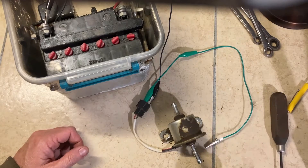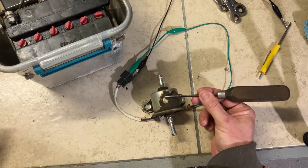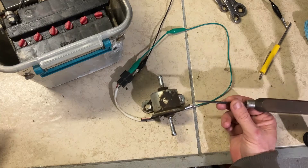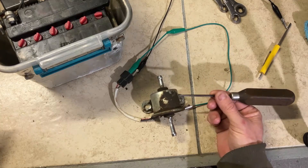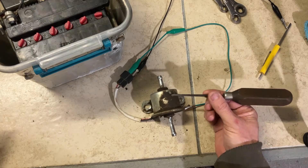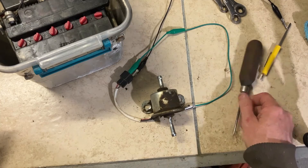That's how I got the machine off the job — tap on one of these pumps and get it to work. Don't turn the machine off because it won't come on after that. I ran and tapped the ZD21 when I was waiting for a part. I had to tap it every time, and eventually it quit working altogether. So the pump is going out and it's going to quit.